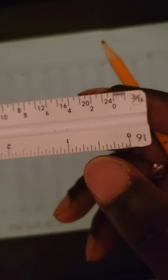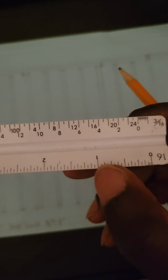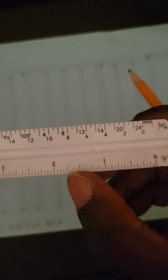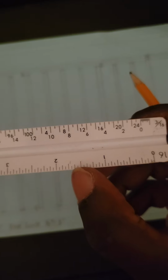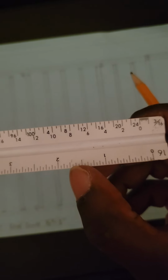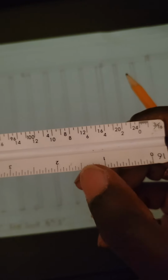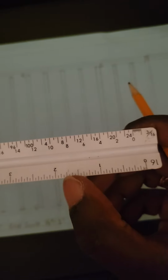Basically, again, you just count these tick marks. So, this is 0, this is 1. You can go until you get to 11, which pretty much stops right before 12/16. If you know it comes out to before, you're good to go that way. Or again, you can just go to quarters, back up 2, go up 2, and you know it's a 3/4 mark. That's the eighths, but for 16ths you basically count by ones. I'm not going to confuse you guys. All right, stay on topic, Mr. Owens. Here we go.